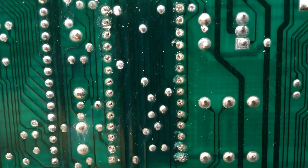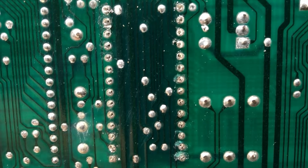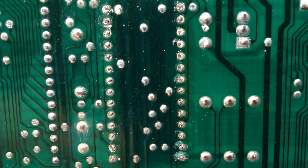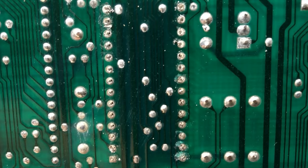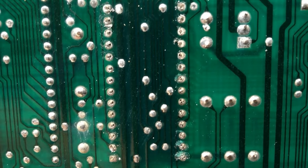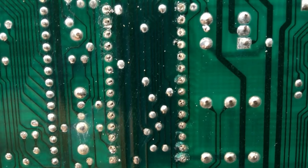So I have de-soldered. Now, in looking at this, I would like to think it's ready to go. Some of them are a little more tricky than others. I'm going to turn it over and try to lift the chip out. What I did in the midst of all that — you may have noticed — I moved around to try to move the pin to the center of the hole. But anyway, we'll see what happens in a moment.